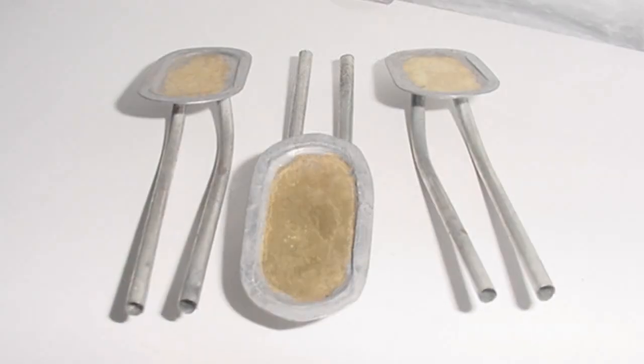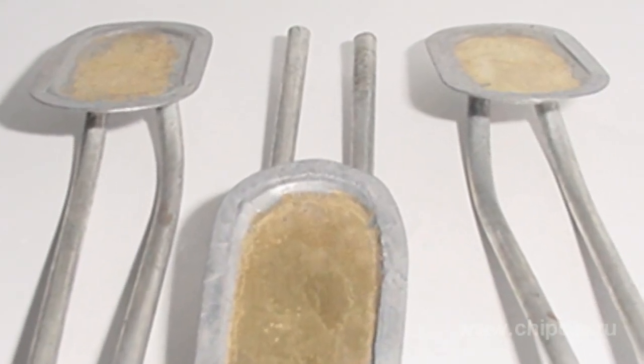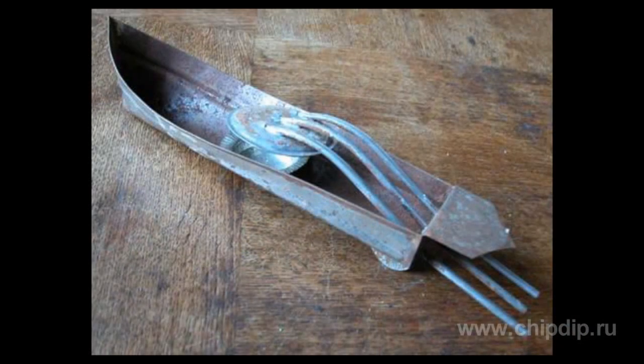The diaphragm engine consists of a flat table boiler and two tubes — the inlet and outlet ones — and a similar process takes place. Water pre-poured into the tube boils and is ejected as steam out of the tube. At the same time, a pressure drop occurs in the boiler which leads to the deformation of the diaphragm. Then the combined effect of the pressure drop and the diaphragm straightening causes a new portion of water to be pumped into the boiler.